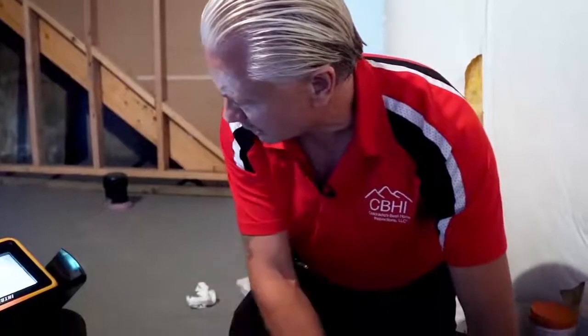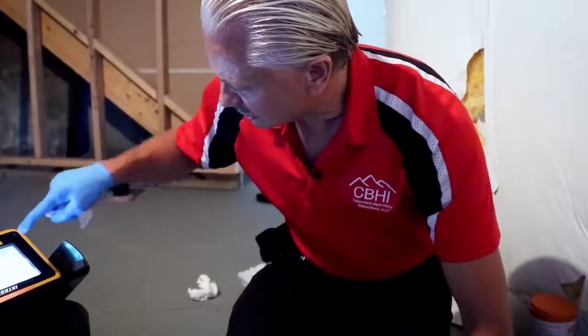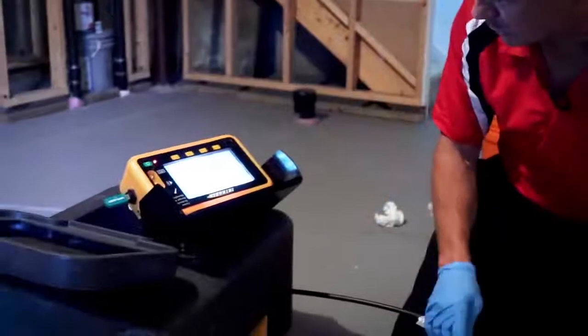Now this is where we transition to SDR. You can actually see right there what's called a Fernco connection. It's a black rubber boot. You don't glue PVC to ABS. All the other joints, you'll just see the joint. Usually at your transition, you're going to see evidence of that Fernco. And like I say, show them that yes, we're still in their line, we're still at their house.